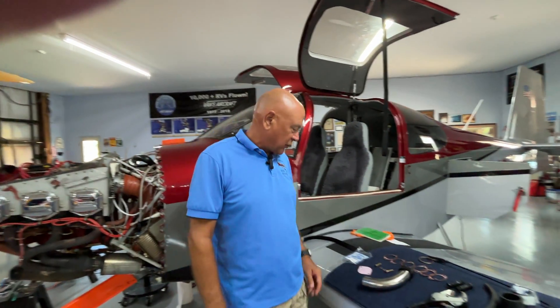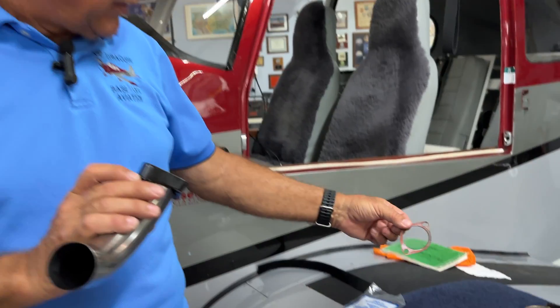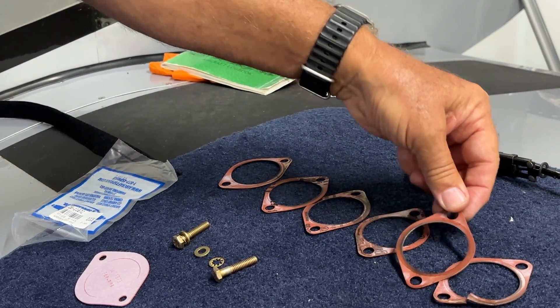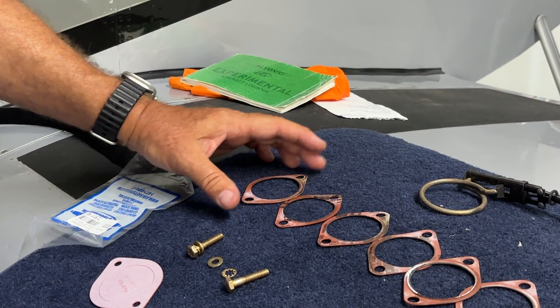With a little bit of time and a flashlight, you can figure out where many of those leaks are coming from. That was the quest I was on this time, and I'm going to show you some of the things I'm doing to stop some of the leaks. It just happens with age. So let's talk about those intake gaskets first. This is your intake tube on a Lycoming engine — on any of the O-360s, IO-540s, O-540s, etc. You've got two places here that actually get aged over time. You've got the intake gaskets right here. I've laid out all six here. What happens is they get brittle — you can see this one is actually wet from fuel, and pulling it off it just kind of cracked. They all get hard. I change these about every 300 hours or so.